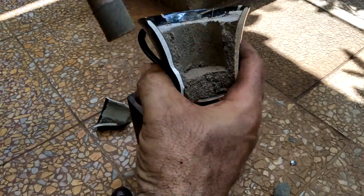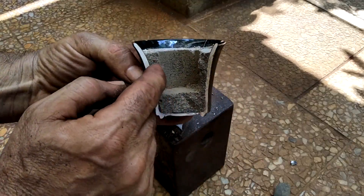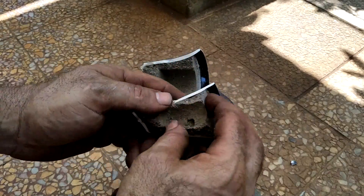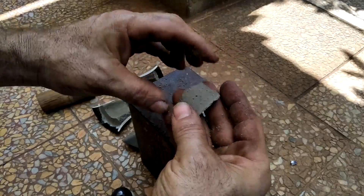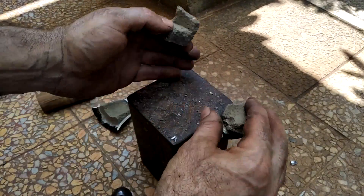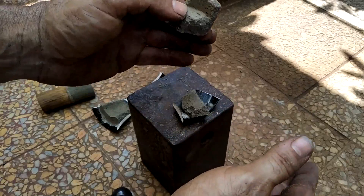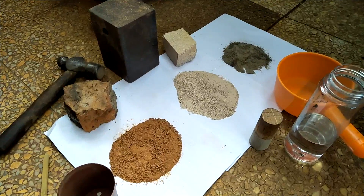It's still very moist inside and the wall diameter is pretty thin — I should have used the metal piece for this size. It's pretty much stuck to the sides. Definitely a total and complete failure. I think it would be better if I didn't use sand and instead broke up a red clay brick, made that into a powder, and added that to a little cement along with a fair amount of the fire brick. We'll see how that works.